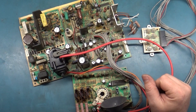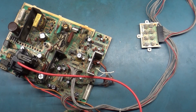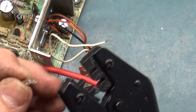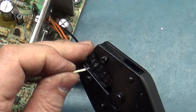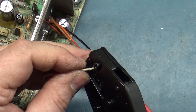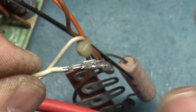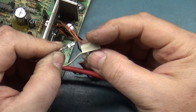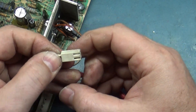Here is the full complete rebuilt chassis. As I was setting this up, I realized we forgot to fix this wire on this connector — let's do that first. We'll get our crimper and our new socket and put that in here like so. We don't want to go too far because then we can't get the jacket in here. Get that through there and simply — ka-chunk — and voila! Perfect. Let's get this back in here — it should go right in. This way, like so. Click. Fantastic.